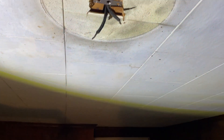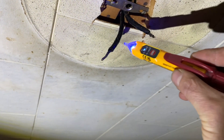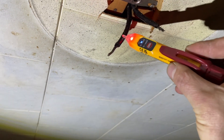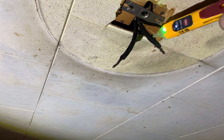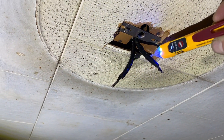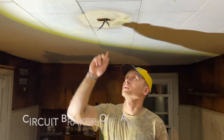Power on — now we've got our power back on. I'm going to grab my tester, just be careful not to touch the wires because they are live. You see it's turning red — that's our hot live wire. Normally this would be black or red, but since both wires are black here we had no clue. And this one is green because it's neutral. That's it — we'll turn this back off now and wire it up. So we know which one is our hot wire.